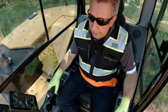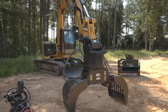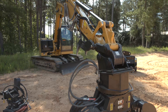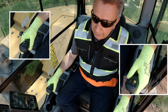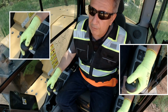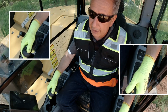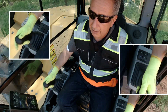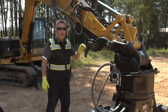Just going to check it, make sure it's clearly on. Now this is a pretty big tool, so you want to get this low enough so you can easily get to the QDs. I'm going to stretch all the way out and put the tines close to the ground. Don't put them in the closed position — if you take this off in the closed position it's actually going to tighten up and create pressure. So I'm going to bleed the pressure off, making sure left and right side are both on the ground the same. Switch the engine off, leave the safety brace down, switch the engine back on again, and roll my auxiliary rollers backwards and forwards to take pressure off the QDs on the machine side. Our machines have an accumulator — the accumulator allows the pressure to be pulled back to tank.